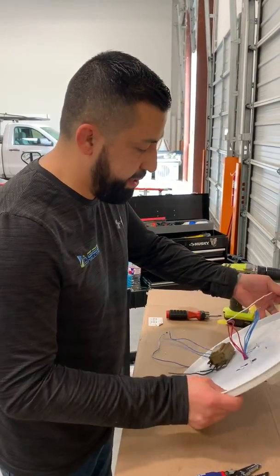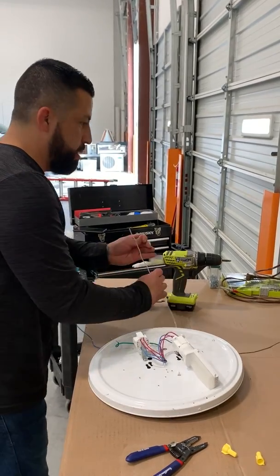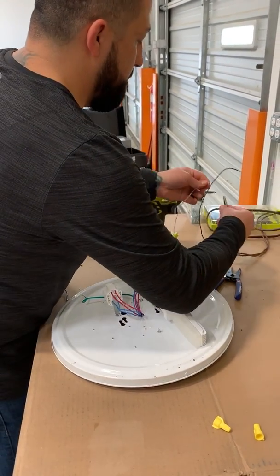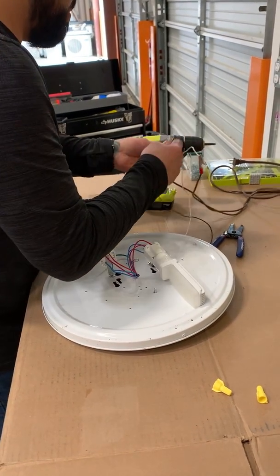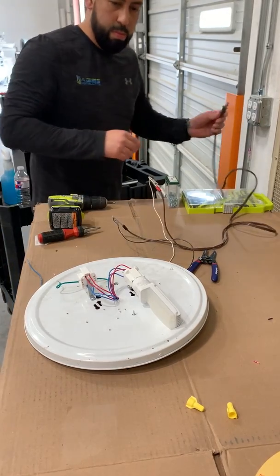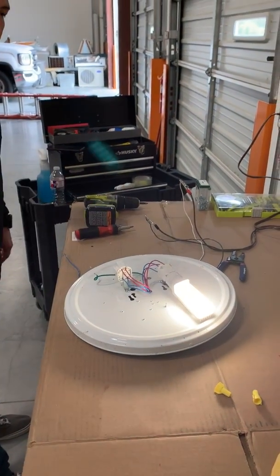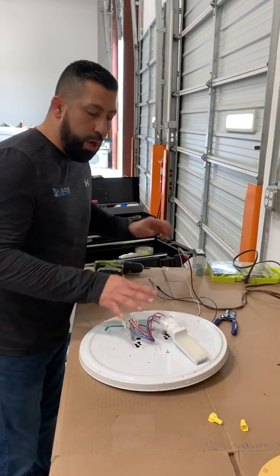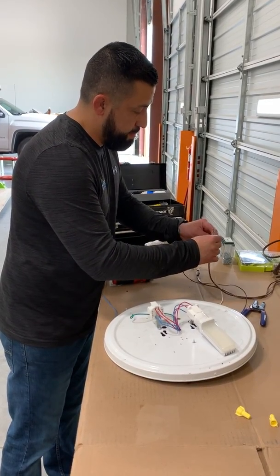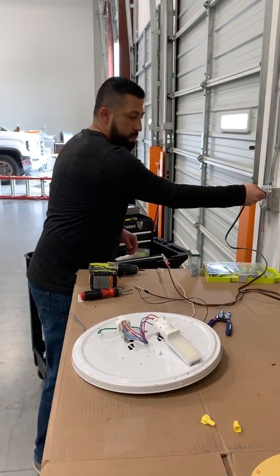For testing purposes, we're going to go ahead and test this. I only have one lamp and I'm going to mock this up real quick so you guys can see. And there it is — everything's wired up. Now I'm going to turn off the power again and switch the hot and the neutral so you can see that it doesn't matter what side you go off of. And there it is.